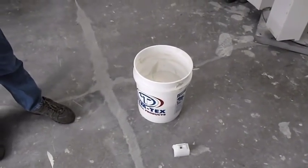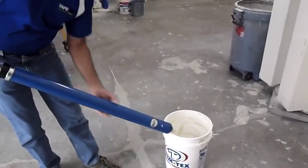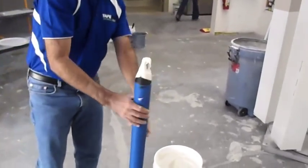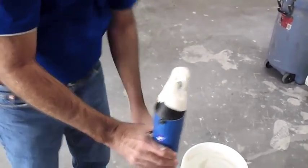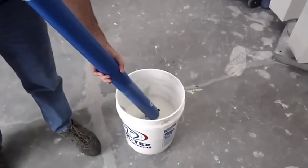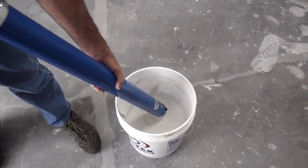To prime the compound tube, fill it up with several inches of compound, and then bounce the air out of the cone, the nozzle. Now that the air is removed, you can fill the compound tube, slightly wiggling it into the compound.